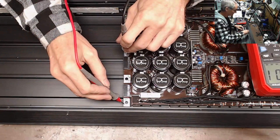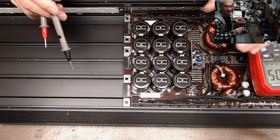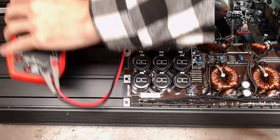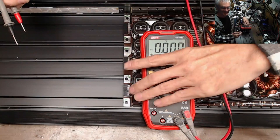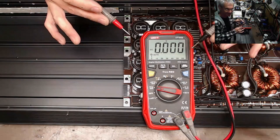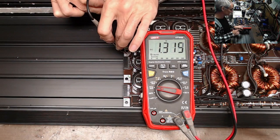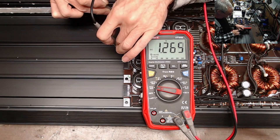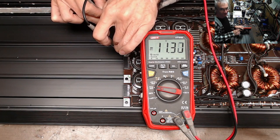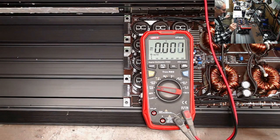If I go to common and positive rail — there we go. There are two separate independent rails on a lot of power supplies. Positive to common, you'll see, is discharged: 1.3 volts — we're safe to touch. Negative rail is at 11.5 volts, still going down, working its way. Let me turn off my primary power so I don't bump anything and accidentally turn this back on.